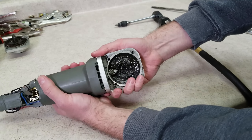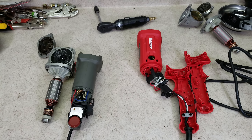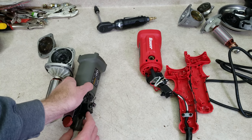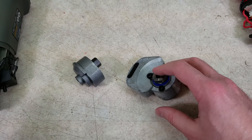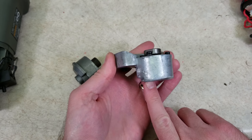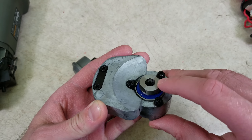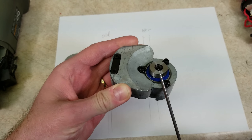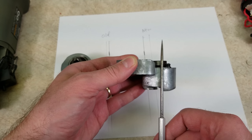I went ahead and tore both of these apart. I'm going to mostly talk about the differences to keep this as short as possible. To minimize confusion, I'm always going to keep the parts from the old one on the left and the newer one on the right. These are both dual-action or random orbit polishers, so they both work the same way — they screw onto the spindle where they rotate, and the pad screws into a bushing which is inserted in a separate bearing and can spin independently.